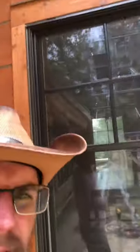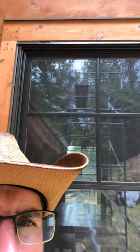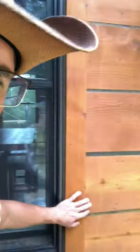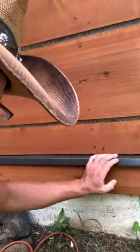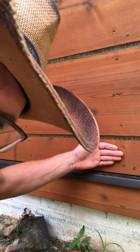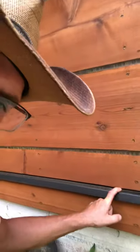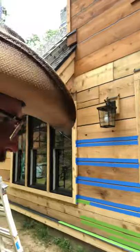I've got some weeps at the top so that if any water gets inside it can come out. This wall is done as siding, so I have a gap and a rain screen behind the 1x12s. I have a gap at the bottom so if any water — through condensation or otherwise — gets there, it will come out from that gap.